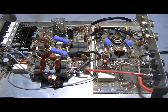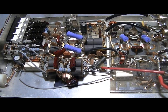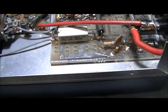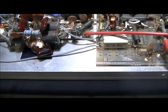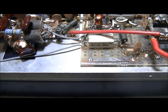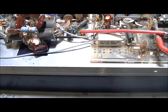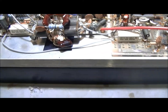On older vehicles back in the day there were positive-grounded vehicles, meaning the vehicle itself was hot - positive. So the case and heat sink would be positive instead of ground. That's why you need those caps to block it - they're just simply blocking caps. We're not in those days anymore, so whenever I get an amp like this I always take all those caps out and put little shorting bars in there to go ahead and ground the case.